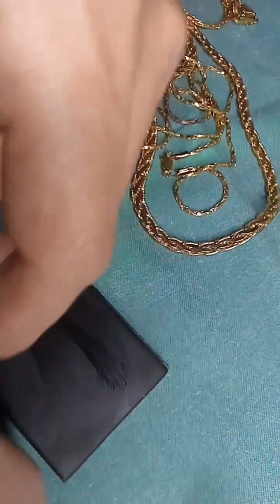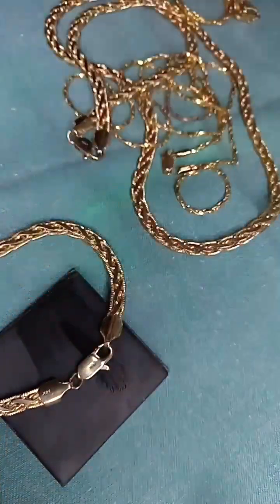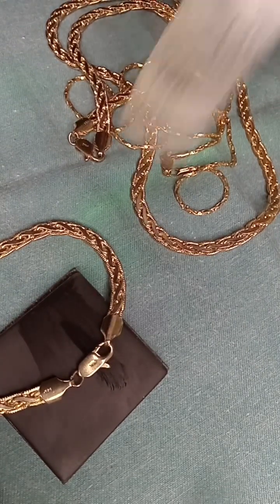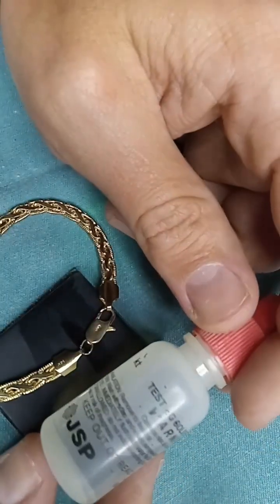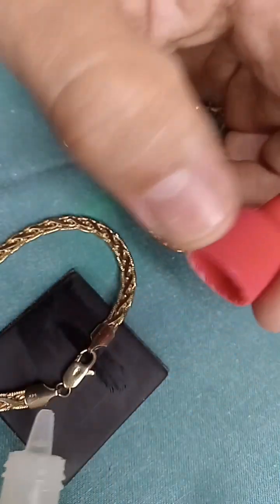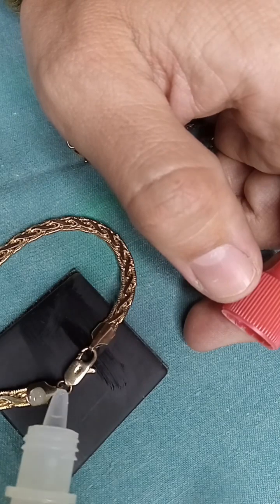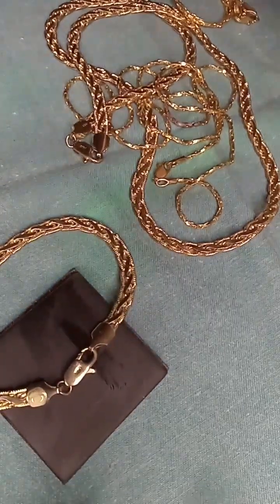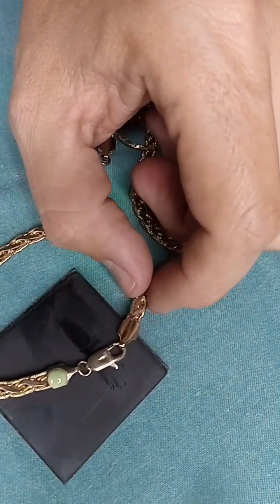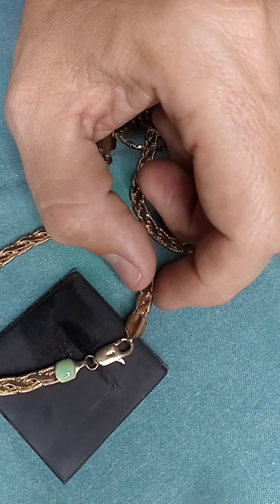In the future for me, it'll be a big red flag. One thing that you can do — I'm going to use 18 karat gold acid test solution to show what happens. It just eats right through the gold plating and starts to eat into the copper. And that's what that green pigment is — it's the copper dissolving.